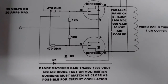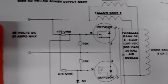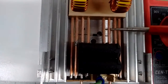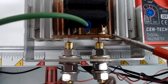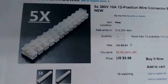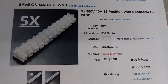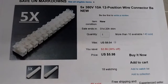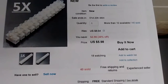Now we'll show the schematic a little closer so you can see what it says. Moving over to the actual unit itself, these copper rails are 10 gauge wire. In the previous video we talked about mounting them on pieces of cut circuit board. But you could also go to eBay and buy 12 position connector bars. With these you'd be able to loosen the screws, slide the wires straight through, and on the ends where the power MOSFETs go you'd bend them to match the leads. You'd just need to figure out a way to fasten these plastic pieces to a circuit board.